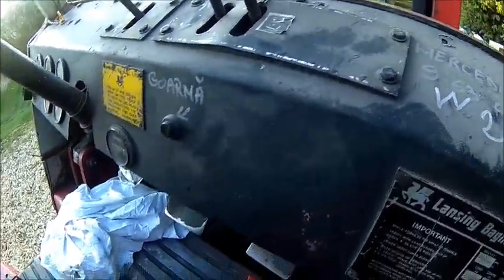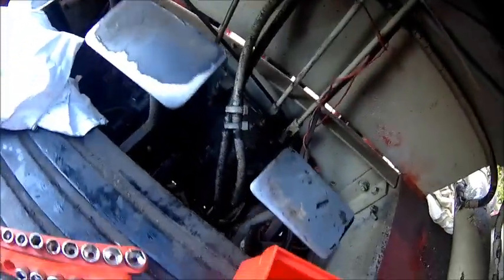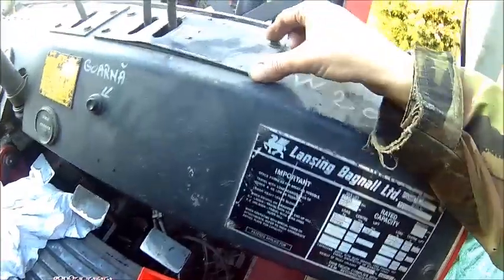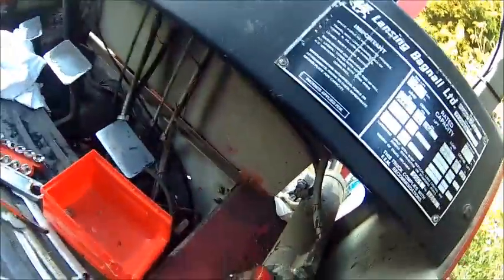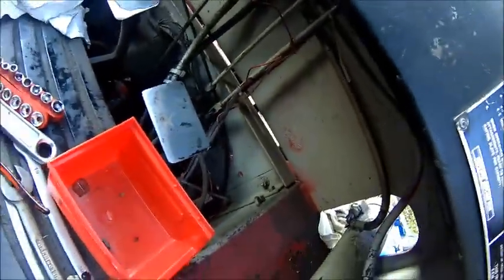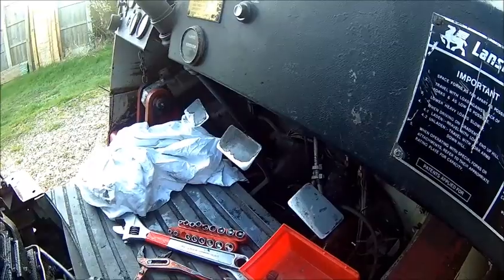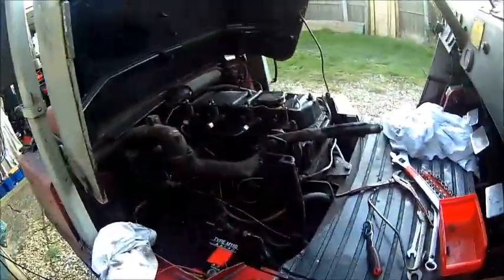I think we found why the lever position is so bad — watch this. There's a bunch of bolts missing over there, so the whole thing is moving. The front panel sits too low, and that's the reason why you can't go forward — because going downwards is the same direction. The pivot point is here in the panel. Look at that — when I pull on the valve, I pull the whole thing up with it. Let me see if the bolts are broken or just not there.